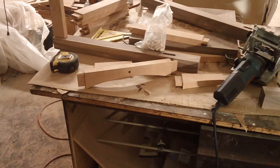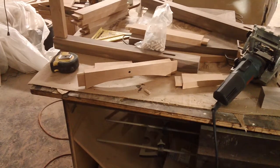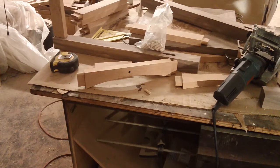definitely on furniture especially. And they also have a system called the Miller dowel system, which is a step dowel. And I've used that too. That's pretty good. And sometimes when I don't want to use a metal fastener, I will combine tenons with, say, a Miller dowel, and just leave that dowel become part of the design there.